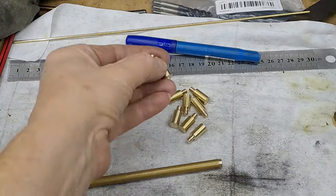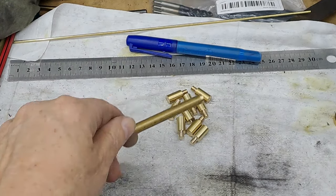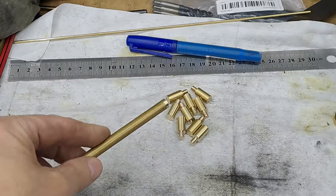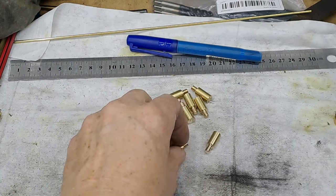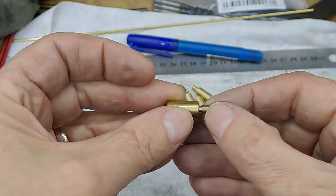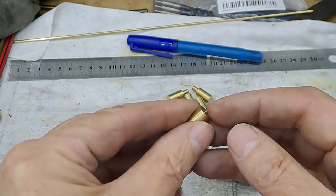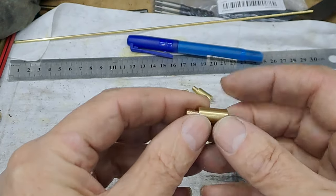Right, guys, so there we go. Made all the little oil cup blanks. There's 9 here. I've got 1 set up in the collet chuck, as the remains of the bar I used to make them from. So what's the order of operations going to be? Well, let's start here. You can see a nice little thread relief. That's 15 mil long. So the order of operations is just to turn that little tip off there.